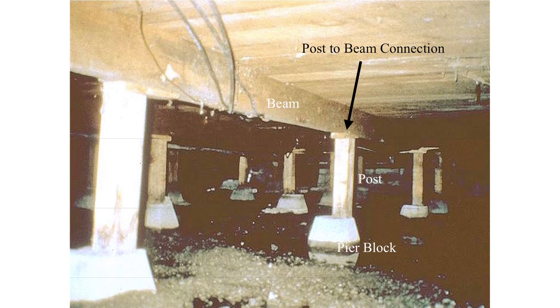These are called posts and beams. Many contractors and engineers worry about the post-to-beam connection, but the building code only requires a positive connection, meaning a few nails. This is true for homes built today right on top of an earthquake fault. This is not considered an important connection. The idea is that if the beam were to move 2 to 3 feet so that the post collapses, that means the rest of the house has already slid off the foundation. For that reason, only concentrate on attaching your house to the foundation.